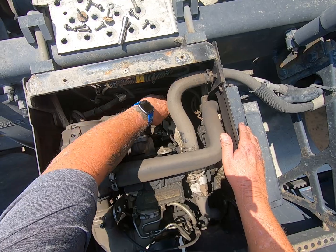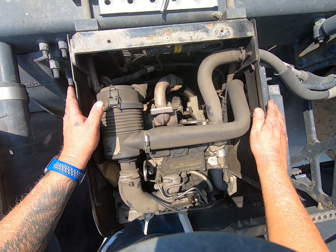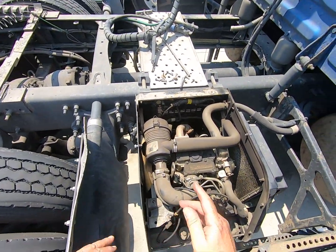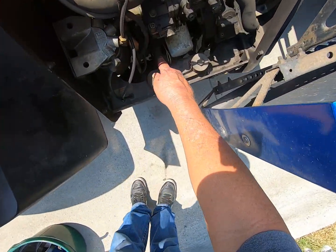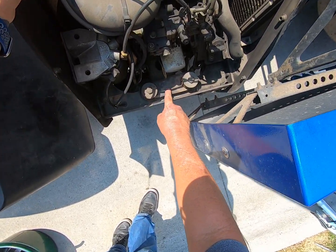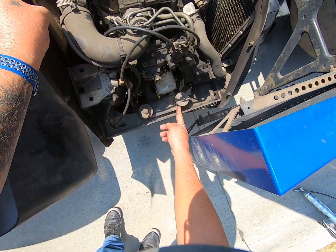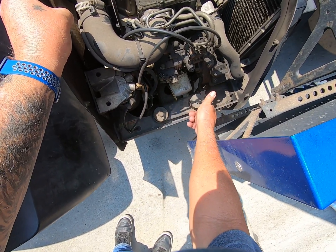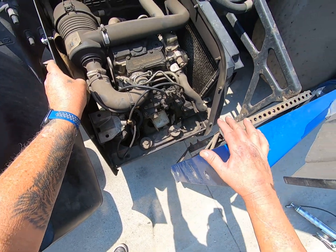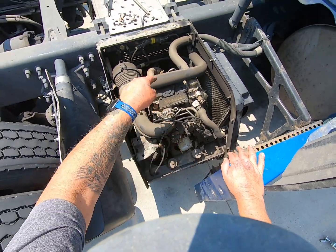You can see, I don't know if you can see, that flex pipe. Pretty sure the reason that flex pipe broke is these motor mounts here. They're rubber motor mounts. You can't see it on the back side. It looks pretty dark, congested back here. I hadn't noticed that the rubbers on the bottom on both sides were bad. Well, as bad as these roads are getting, the motor mount on the back side broke.